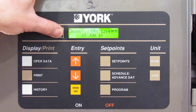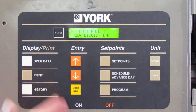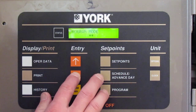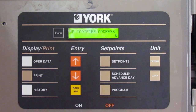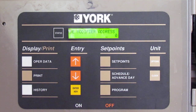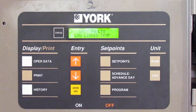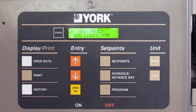And that's it in a nutshell. The BACnet settings are pretty easy to access as well — press the program button, go down four times, press enter, and you can get into your BACnet addresses and set this up for the building. I've already done a module on that with a real chiller — check my other videos. It's a good one if you're commissioning and stuck on figuring out how to get the address to work.